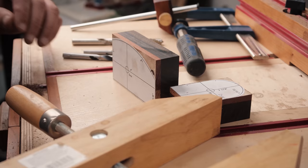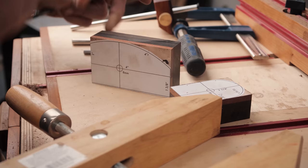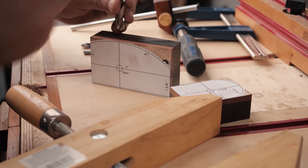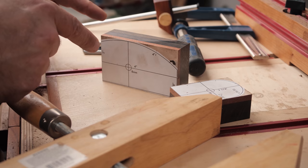We're going to drill a quarter-inch hole until we see it come out our eight-millimeter hole. You can set the depth on your drill press if you have a stop. Then you're going to take your 25/64th bit and drill down a half an inch — that's going to allow you to set the threaded insert. You're drilling down a half inch from the top of your template or whatever design you chose. Then I'll show you how we put in the threaded inserts and finish these up.